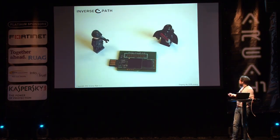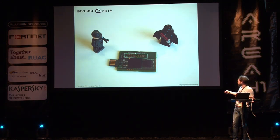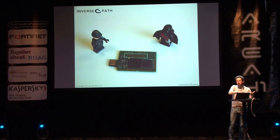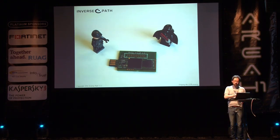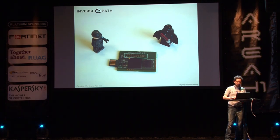So this is the alpha board that we made, the very first one. It is, of course, bigger than the final product because we wanted to have a JTAG header easily accessible to understand what the problem was if the board would not boot up. And we made it so that we could also cut the excess PCB compared to the original form factor, so that we could also test the original form factor. Even if it wouldn't make much of a difference, maybe for heat dissipation it could. So it was designed in that way.